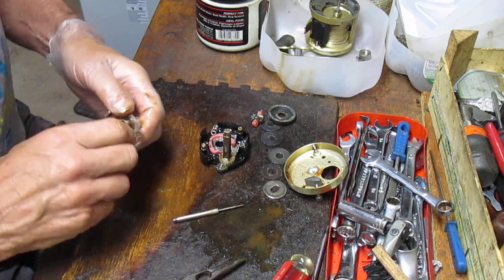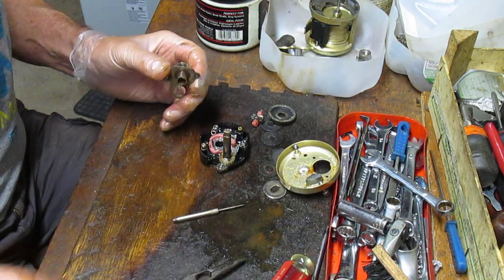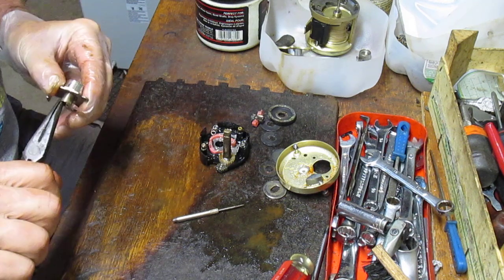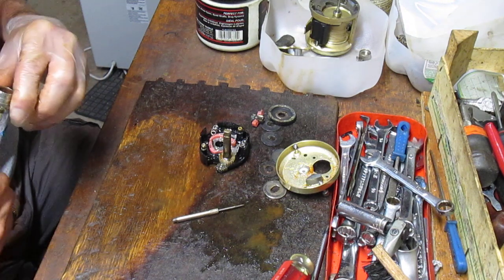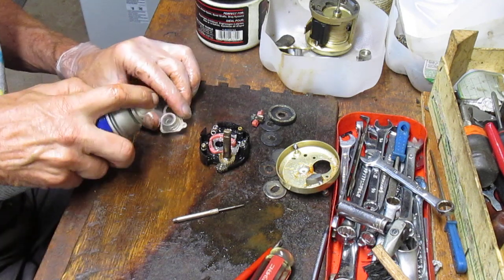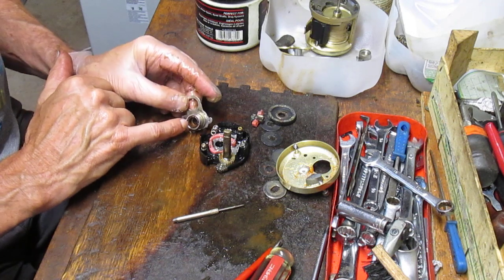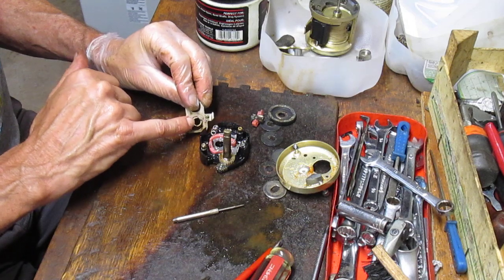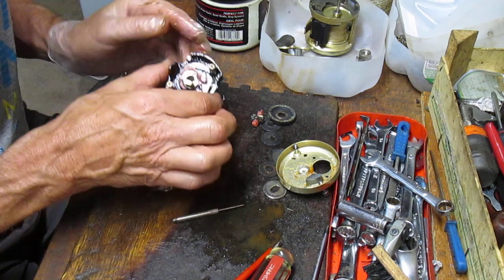Okay, so let me just take you through the reassembly of this, short of putting the side plate on, because I'm going to have to leave that one for another day. But in the meantime, we did want to get this thing identified, at least from a problem perspective, and we've certainly identified the problem here. Poor maintenance practices have led to the corrosion of the anti-reverse gear, freezing the ferrule from the main drive on there, and that all needs to be replaced now.